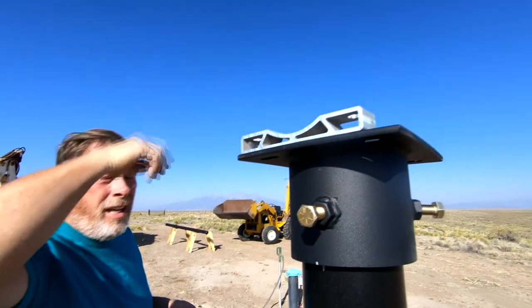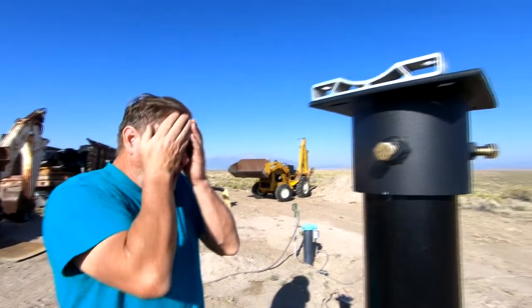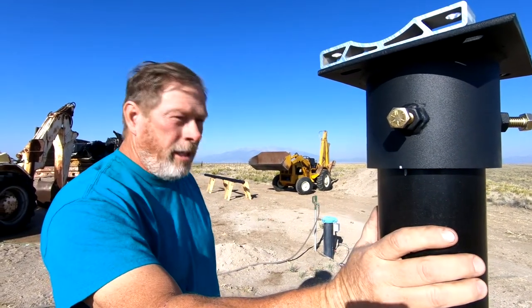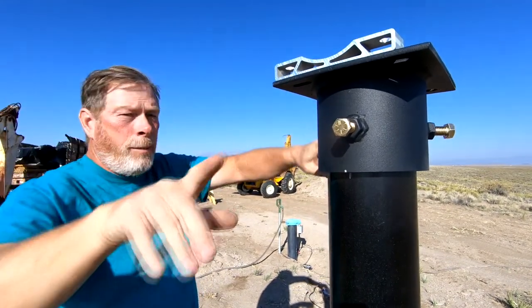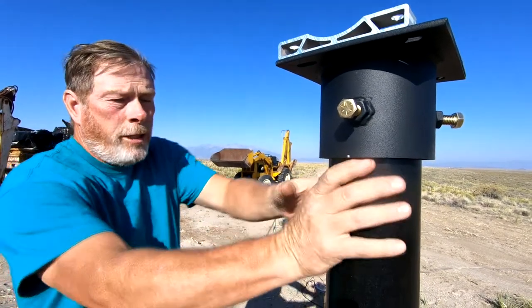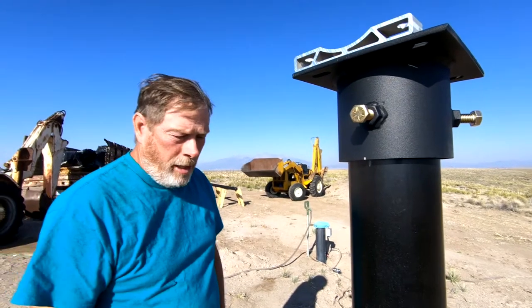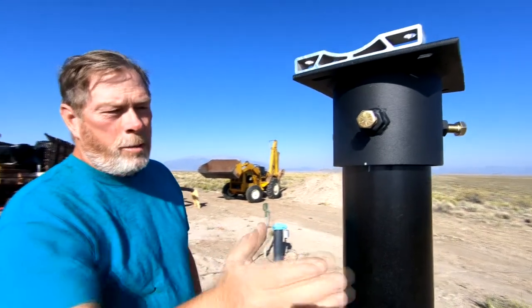This Sunrack system is designed to handle hurricane-force winds, which is important to us here at Contimi because we get some really high winds — max gusts to 90 miles an hour in the spring. It's important that we have something that can handle not only the weight of all these panels but also the wind forces we get. We sank this pole quite a few feet down and it's really cemented in well. You need to make sure the pole is sitting in the bottom of the hole, because that pole over there is over a hundred pounds by itself, and then you've got a couple hundred pounds of solar panels on top. In this case, this pole is about half of its depth in the ground.